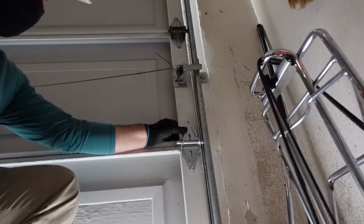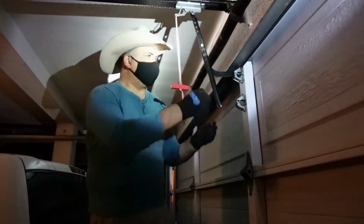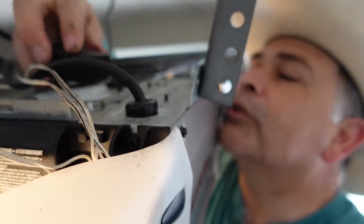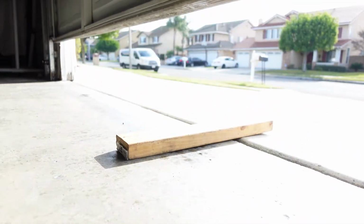So: cables, hinge, roller, chain, rail assembly, J-arm, lubrication. Like I said, a minor door service is trying to get everything positioned and properly set with this door. Is it 100? I would say it's probably about 98. Long story short, the door is older, a little bit beat up, and has some issues. I made an adjustment to the motor system with the travel. I also checked a number of things. I checked the safety reversal feature, and it's obviously hit and miss sometimes, particularly if your balance is bad. The balance is good, the safety reversal feature was working okay, and the sensors are working okay.